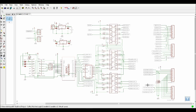So again, there you can see I'm using VCC from the coffee machine. I'm using that to drive these things out. So again, no electrical connection between this controller and the coffee machine default controller. Additional bits on the controller board are going to be just a 5 volt rail to obviously power the Arduino. The key being that the controller has to keep functioning even though the USB is disconnected, right? So the coffee machine can continue working with or without a PC being present. I'm still hunting for a 5 volt supply inside the machine, hopefully, which should just keep the whole thing running.